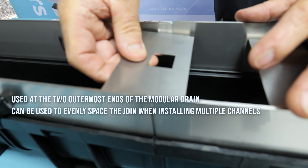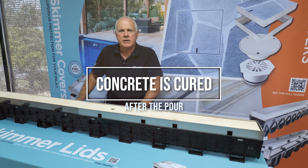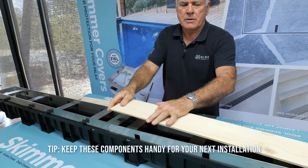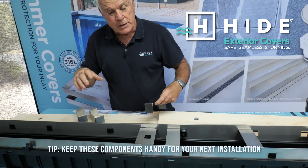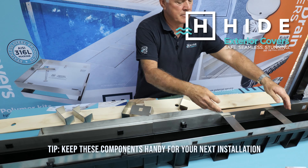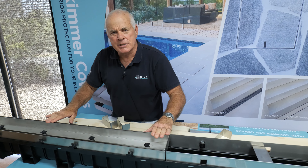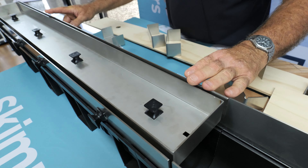Let's imagine the concrete is fully poured and the lids are full of concrete and we're ready to go. Remove the cover plate through the entire system, then remove the spacers that have been located at the bridge positions of the lid. The concrete pressure will hold the lids back into place, allowing the lid to slip into location — completely seamless with two water-easement clearances.